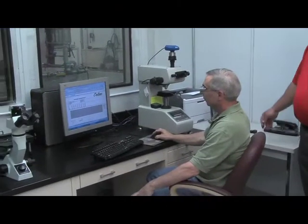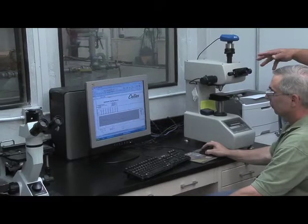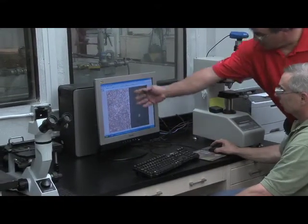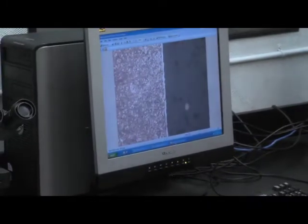This is the second half of our metallurgical laboratory. In this room we evaluate the core hardness, the microstructure, and the case hardness. Greg Lynch right now is actually evaluating a nitride case where we've done a trace on our micro hardness tester. It generates a hardness versus depth graph which we log and keep as a permanent record for every lot that we run here. We also evaluate this white layer here to make sure that our nitriders are doing exactly what we expect them to do, because this nitriding establishes the fatigue strength and endurance limit of our crankshafts.